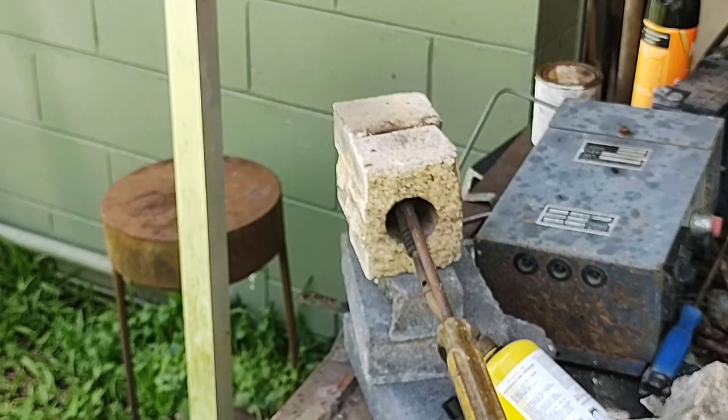So I'm going to back them off and temper them, and I'll show you that process after I do this process of reheating and quenching them. So I'll go through that now. So you'll see it reheat. I'll quench them right below what I'm showing here now.